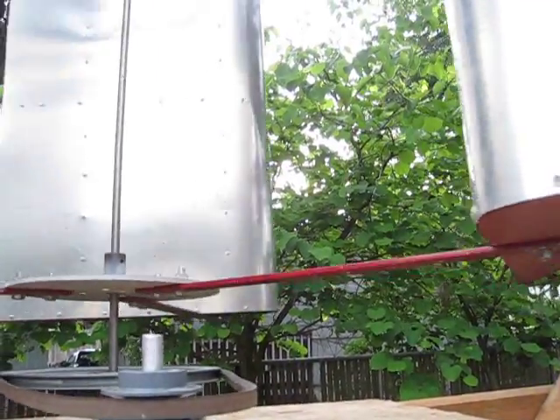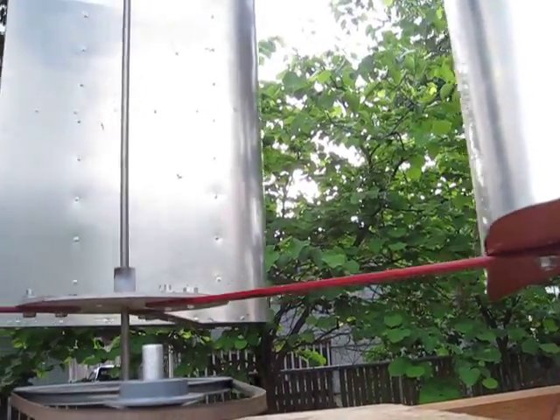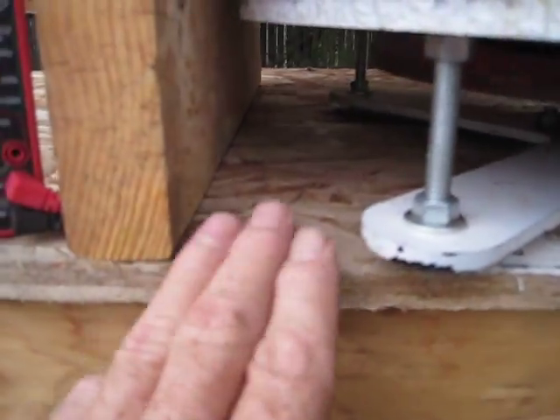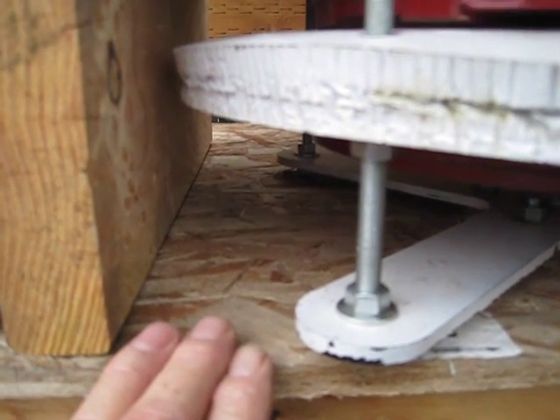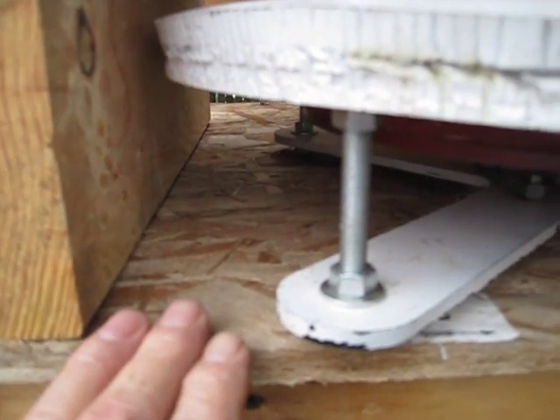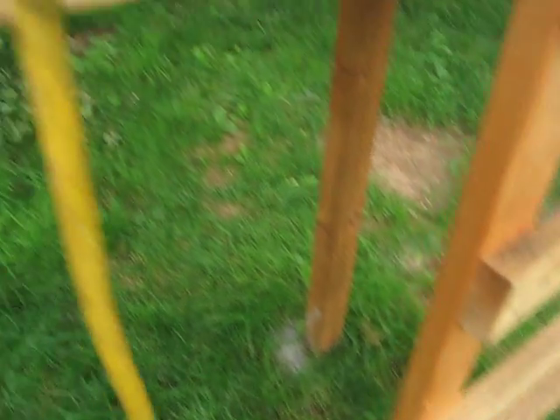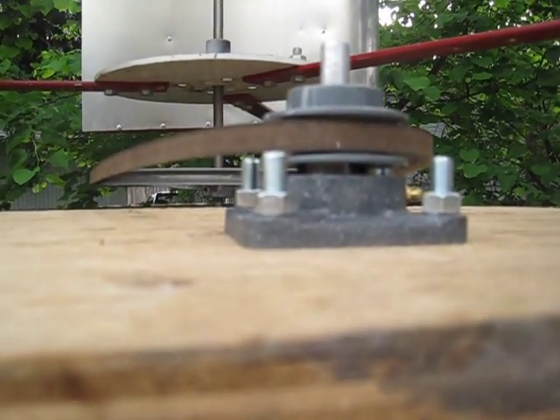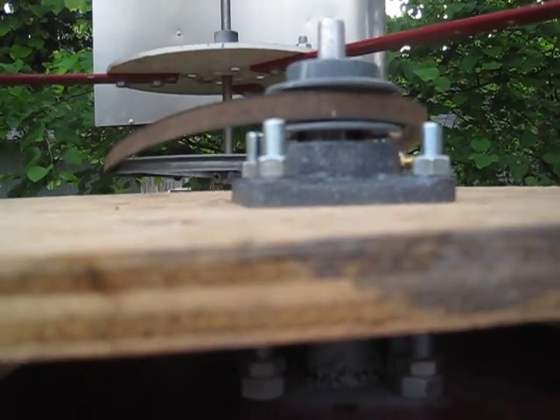So now we've got to start playing around, doing a little fine-tuning here and there. I had to level this whole platform out again because it was leaning towards the front — the front had sunk down in the mud a little bit. So I had to bring them back up and then screw the frame on there and level it out. It was throwing the shaft off where it locks into the collars and into each of the block bearings. So I got that adjusted now — everything's nice and level.